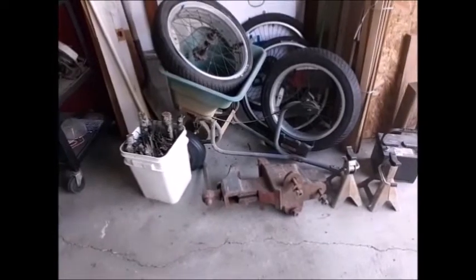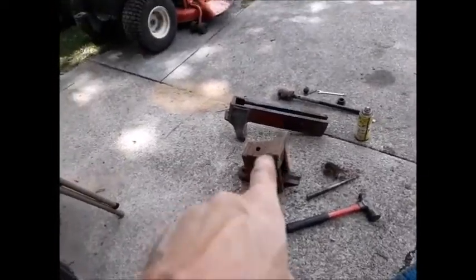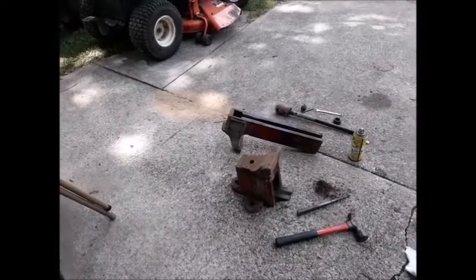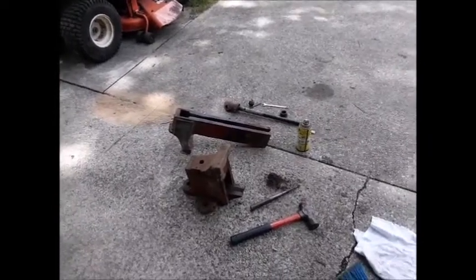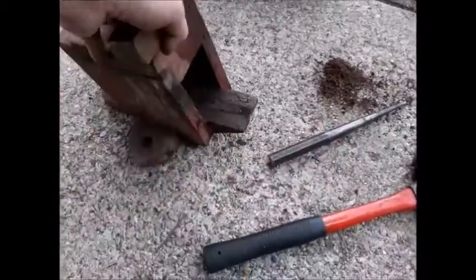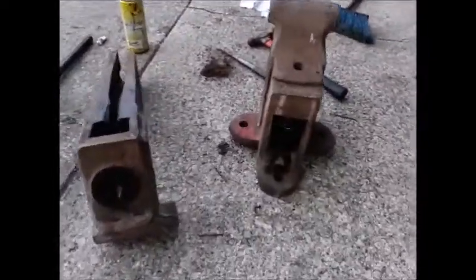I haven't inspected it to see if there's a name on it. I'm going to venture a guess that it's made in America — it's old, probably is. This big honking vice — it's got to be the right day of the week that I can lift that thing. I wasn't going to do much to it, but I couldn't even unscrew the lead screw, so I started spraying penetrating oil on there and got that out and cleaned it up. I thought I'd put it back together and all this crud came out.